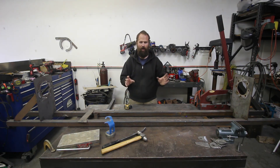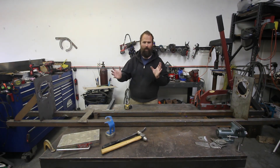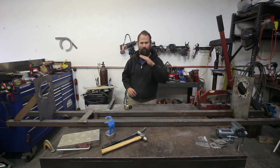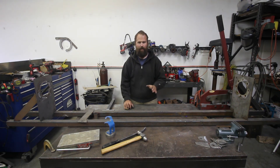That job was a lot easier — not having to cross measure, angled, centered — I was able to put it together from hub to hub and mock it up under the vehicle to figure out ride height. That vehicle was going to be lower than if I had just winged it from the start, so those mounts hung below the frame a little, and I just boxed that in, which looked really good. The fixture in that case was for a lowered car, but it still made my life a lot easier.